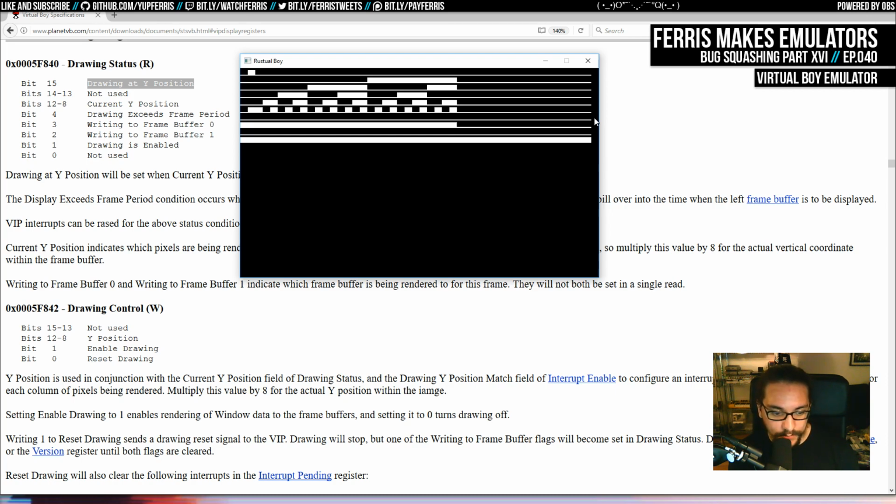We would hit the max if on the hardware and not the emulator if the bits changed differently, like if we captured that many. I don't think it would be. It could be the CPU running faster. It could also just be the state changing more often, which is what I would more expect. Just to note, these are different bits of different registers that we're watching. This is the drawing status register.